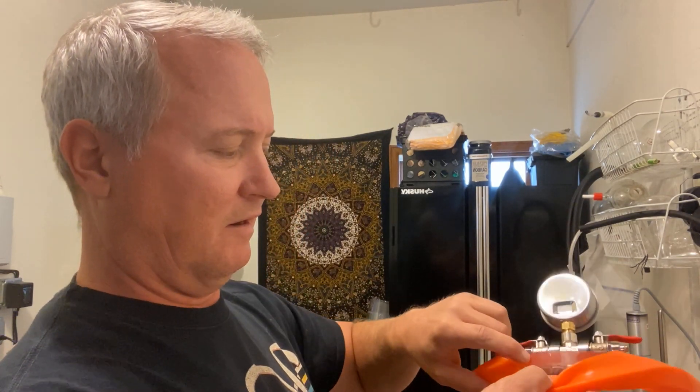The other way is when you look at the grind on the side and feel it. With polycarbonate and acrylic it feels kind of plasticky — not real dense, not real hard. When you touch glass it feels a little more hard and a little more scratchy. Acrylic feels a little more smooth than polycarbonate. Polycarbonate actually has a fairly clear-cut edge on the side, and when you feel it, it feels plasticky.